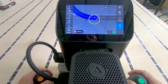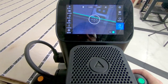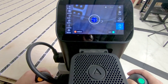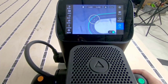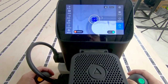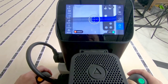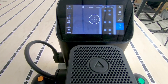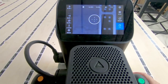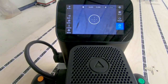Origin is correcting as I move — coming down to the edge, keeping cables out of the way, around this corner as well. This is a quarter inch deep roughing pass. Then we step over and do things like the handles — another area a track saw is no help for, but with Origin you can zip around quickly.